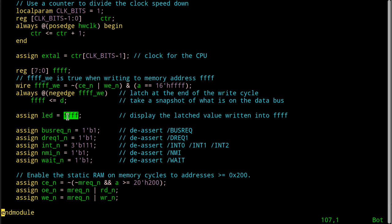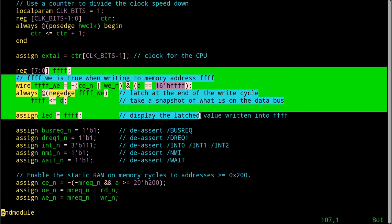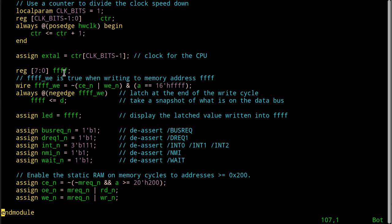Okay, and then the other difference in this file is that the LEDs show me the contents of my FFFF register. So what all this stuff is doing is it's saying, let me look at a copy of what was last written into the SRAM memory at this address. And because of what I explained earlier, the only way that this value here can actually be recognizably correct, with all LEDs on with two of the LEDs off, is if and only if